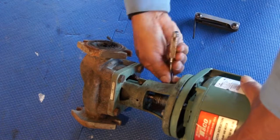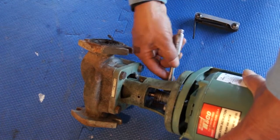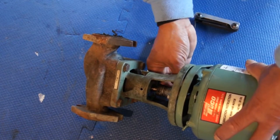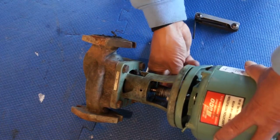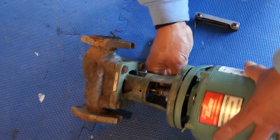These things last you forever, man. This pump can run 20 to 25 years, really. They're expensive but they last a long, long time. Like I said, the only things that go bad are this coupling here and sometimes the assembly seal, because it's ceramic.